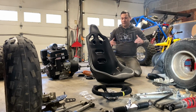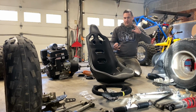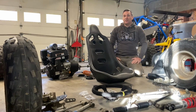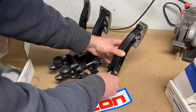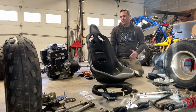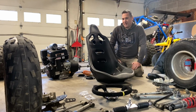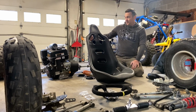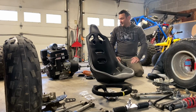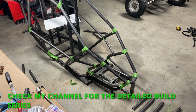The third huge savings, since this is a Predator motor and not a complex gearbox, there's no clutch, it's just brake and gas. So I just got gas and brake pedals. Too easy. That's going to save, I don't know, $1,000 on that racing pedal set and the extra master cylinders. I'm going to run the front and back brakes all off of one master cylinder. So it's going to be 50-50 braking. You could just run front brakes or just back brakes, but the hubs have the brakes on them. It was super easy to get a used rear ATV brake, and the disc came in that $300 rear axle setup.